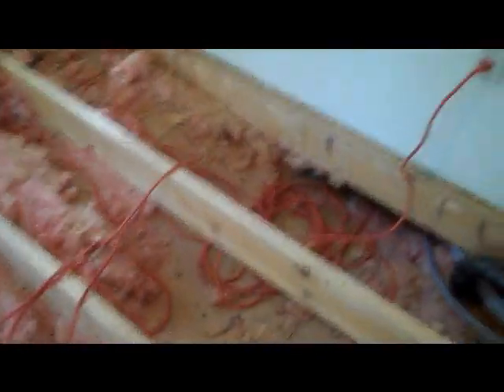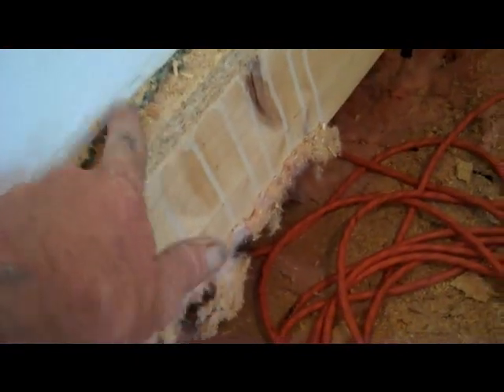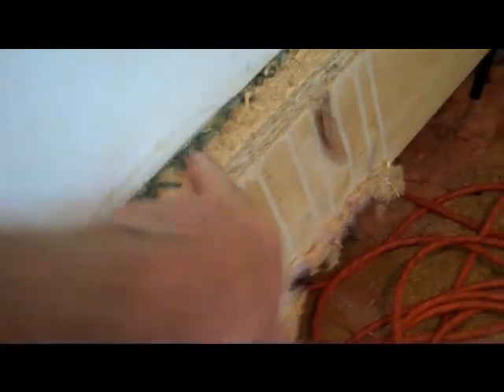On this wall here you can also notice that it's flush right here. I can't bring my floor over to here because this stuff is in the way, so it's going to go. I'm going to take about an inch of it out right through the wall so it looks like this down through there — that little ledge. That little bit right there has got to come out so we have the same ledge all the way down through there. It gives us something to nail our plywood to.